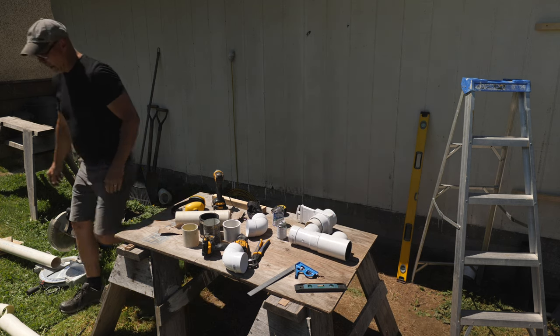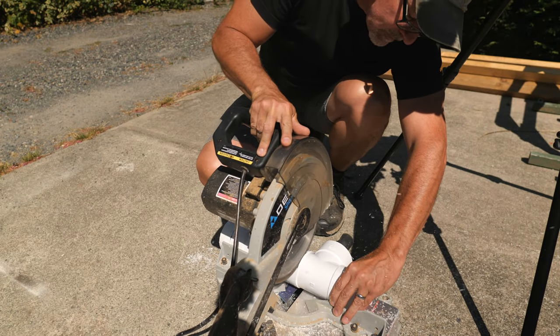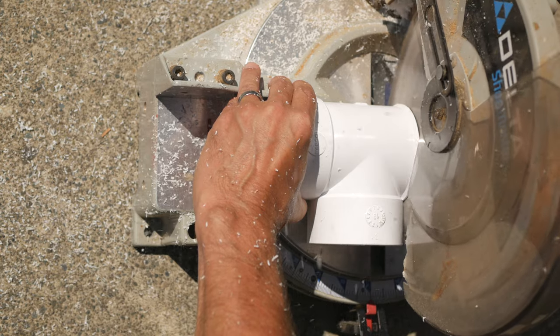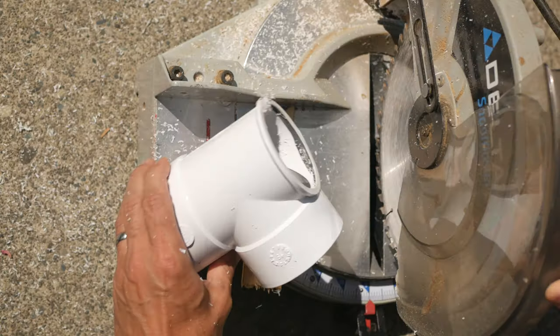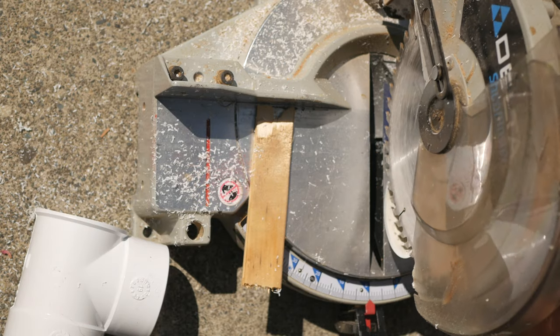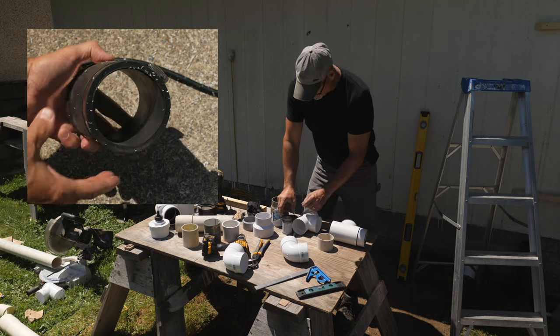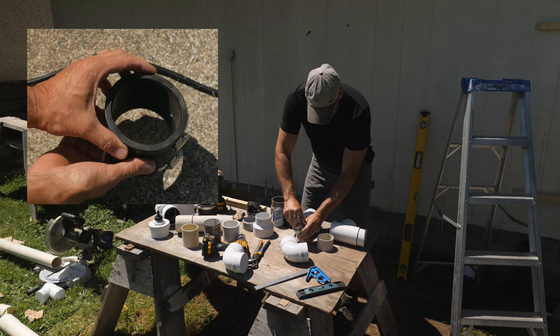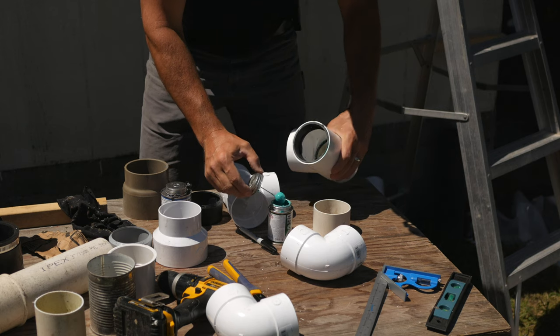There was rain in the forecast. I realized to fix it I had to separate those two T's, and as I mentioned the glue is unforgiving. I had to cut off most of the standard T and glue a new one on the first flush T on the other side. Later I'll use a rubber coupling to adapt that messed up end of the first flush T to the pipe that heads to the tank.